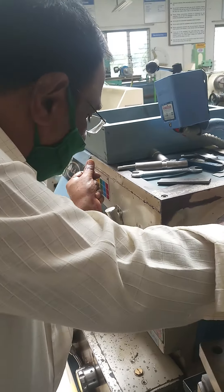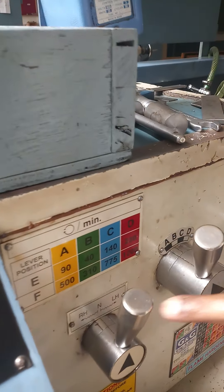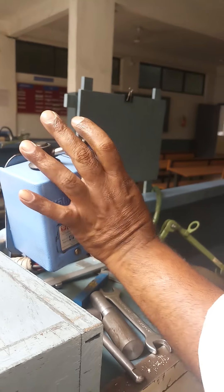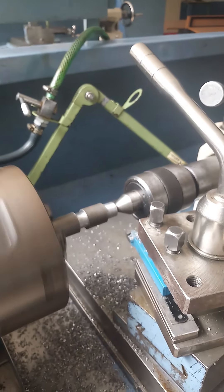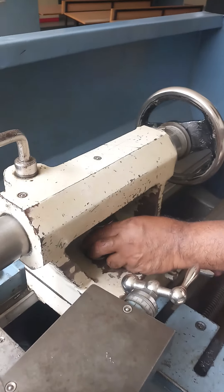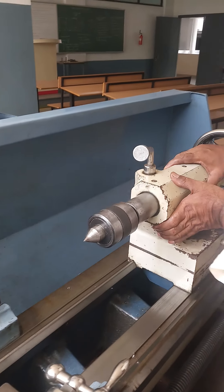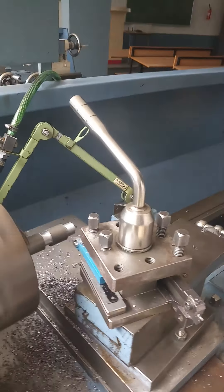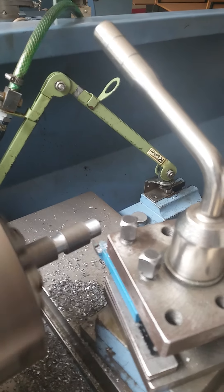For this operation, select a speed of 500 RPM — set the gear lever to the 500 position. Switch on the machine and position the tool to the turning point. We also have to move the tailstock away from the center, otherwise it will touch the compound slide. Remove the tailstock, then position the tool using the carriage.